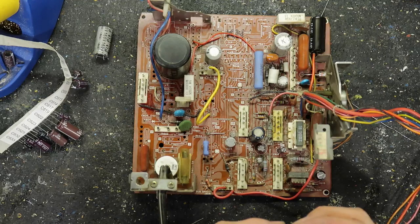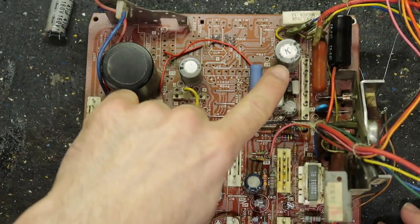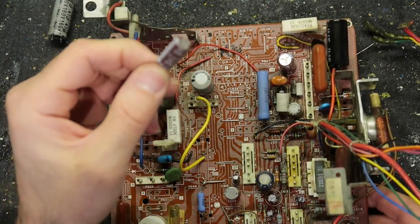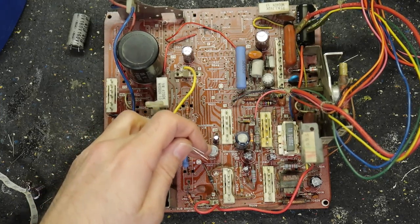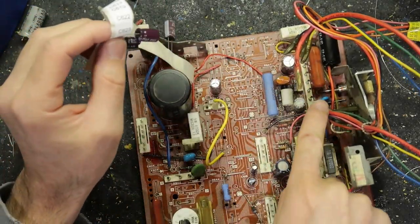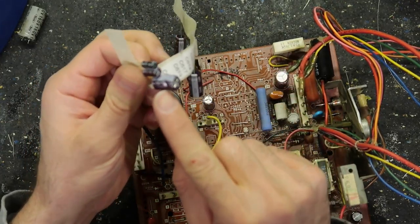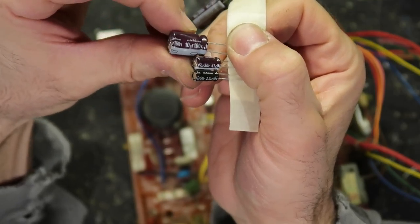C617 is 1 microfarad 50 volt. Same thing — 1 microfarad 50 volts — this time going into C619. C622 is this big fat guy right there, it's going to shrink a bit — it's 1000 microfarads 35 volts. C623 is right here — the new one is 35 volts 470 microfarads, the old one is 25 volts 470 microfarads. Next is C624, that's this one — 100 microfarads 25 volts. Almost done. C625 is 10 microfarad 160 volts. This new one is damaged big time — super smashed, see that big dent in it — so let's go find a new one.